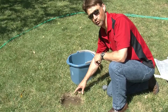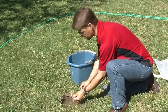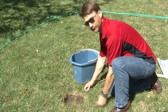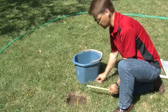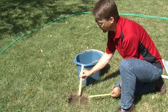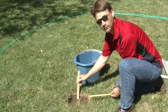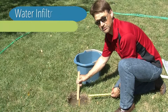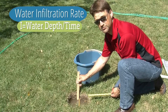After you've filled your hole with water, take a small stick — or as I'm doing here, a pencil — and stick it into the side of the hole right at the water level. As the water drains, you can take your tape measure or ruler and measure from that pencil down to the depth of the water. Do this until the water drains out of the hole. Use these calculations as shown to compute the inches per hour your water drains into your soil.